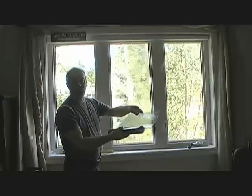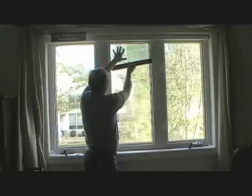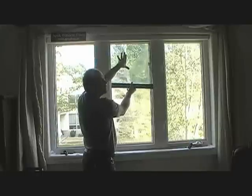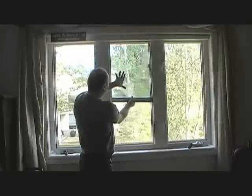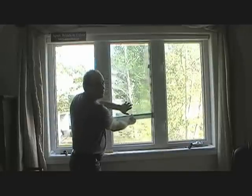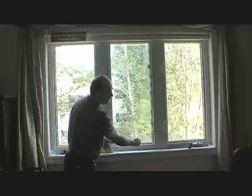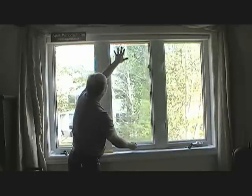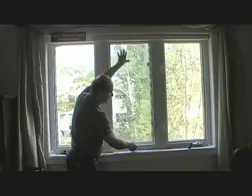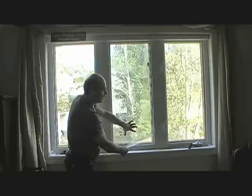You'll see quite soon that when you put the IR-70 up, you're not really sacrificing — you're gaining. And one interesting thing about solar film: even though you're blocking out a certain amount of heat during the day, it has an insulating factor. You're going to retain heat at night, all those times where you want to keep it — blocking it from the outside and keeping it on the inside.